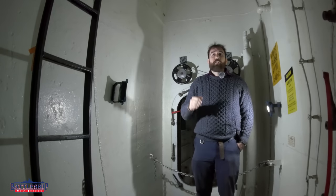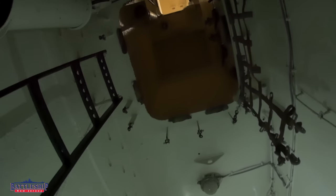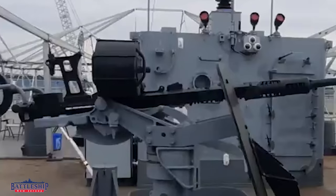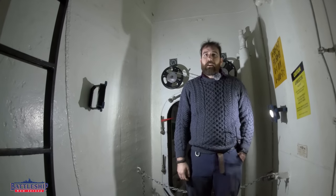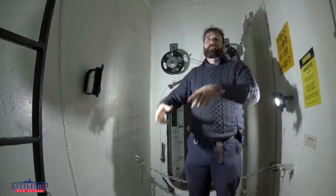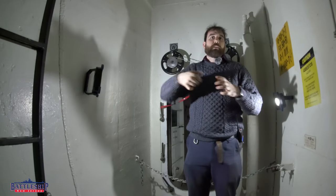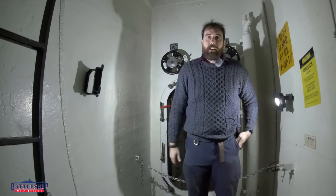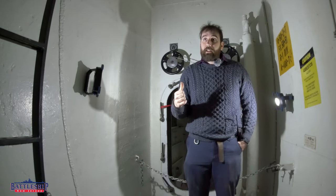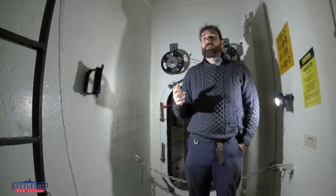First off, the trunk — there's no hoist to get the ammunition out of here to the guns. The ready-service ammunition would be stored in ready-service lockers by the guns, in drum magazines that you load into the 20mm gun. Down here you've got loose rounds in ammo boxes, transported from the ammunition ship or port onto here, then to a clipping room where they're loaded into their magazines and taken to the ready-service lockers. In combat, you're not really coming down here; hopefully war has been declared and you're under wartime steaming with actual ammunition in your ready-service lockers.